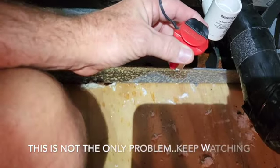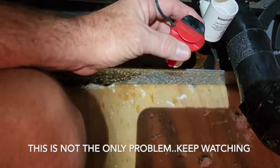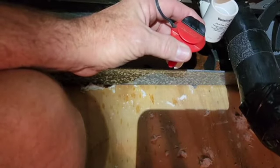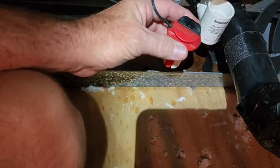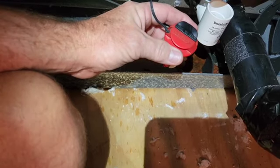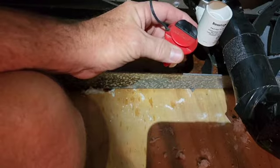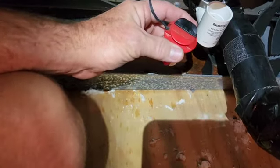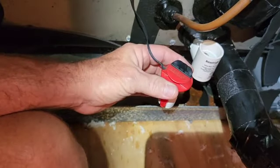That's when I realized I think the problem is with the switch. Now, the switch is a great thing to have — this float switch — because it prevents your condensation from overflowing the drip pan that's capturing that condensation and draining it outside. But I don't have a flooding problem; I don't have an over-condensation problem. It appears that there's a malfunction in the switch.